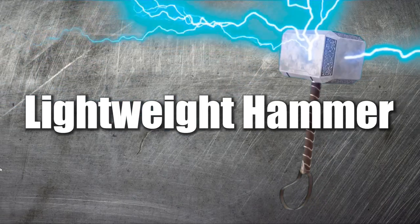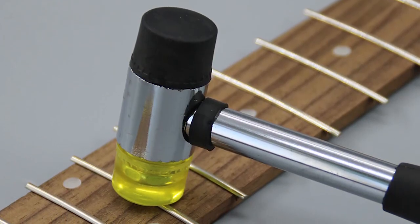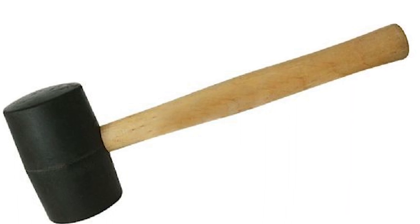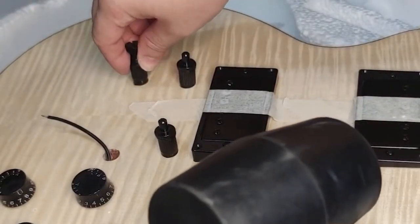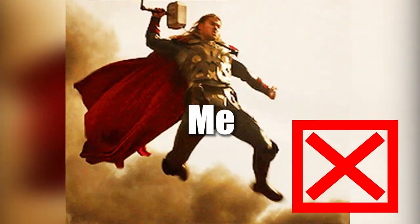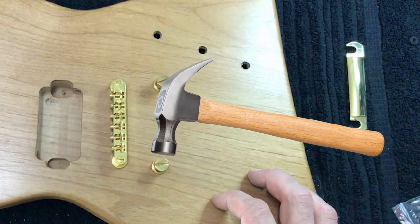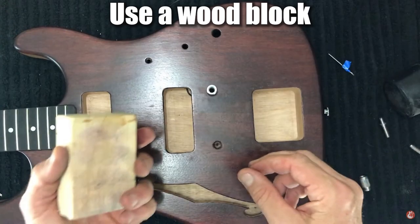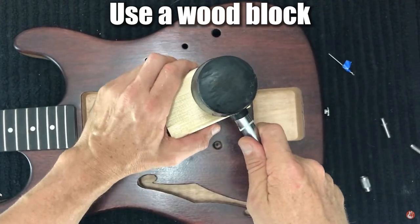Lightweight Hammer. We don't need Thor's hammer for this — we need a small hammer, or ideally a builder's mallet, which is required if you're working on a guitar that features a tune-o-matic bridge, as the bridge and tailpiece pins need to be hammered into place. You need to be gentle. You should not hit the pins directly if using a standard hammer, as this will damage its texture or chrome finish. Always use a cushion like a wood block to cushion the impact and avoid scratching the hardware.